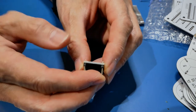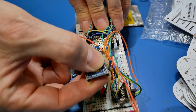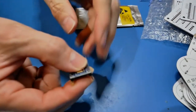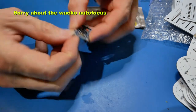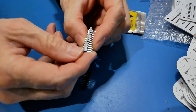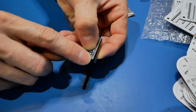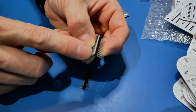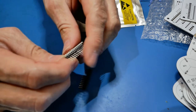If you were doing this on a breadboard, one common thing is to stuff the headers into the breadboard to use it as a guide to hold them straight while you solder. But if you don't have that available, you don't necessarily have to have both headers in at the same time. What I'm going to do is just press on the pins - you can feel when they go flat - look at it from the side, then solder just one pin to anchor it. If it goes crooked you can just de-solder that one pin, realign it, and then let it solidify.